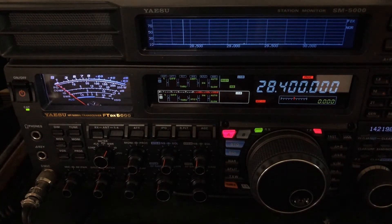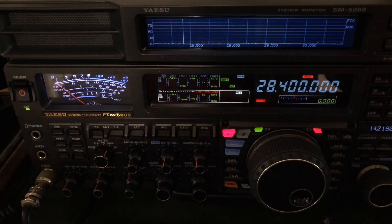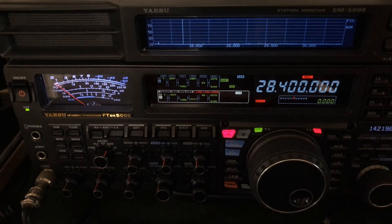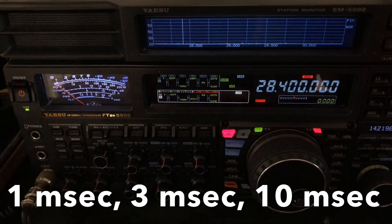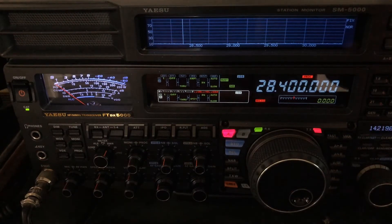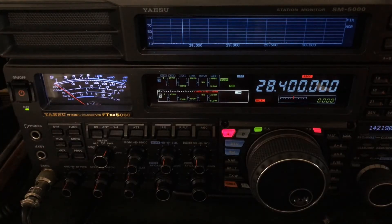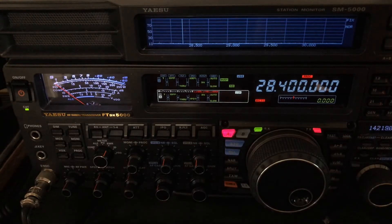So that's why you want to use minimal levels of timing and rejection level on wide mode. Those of you who have the FTDX-10 — I just did a survey, and it seems that most people watching my channel have an FTDX-10 — in your menu you're going to have the options to go in there and set the timing, and then you have the rejection level and you can set that. You want to run those as low as possible — three milliseconds... I think it's one, three, and ten. One millisecond was enough to take care of my power line noise, so I don't want to use three. And then on the decibel level for how much rejection, run that as low as necessary.